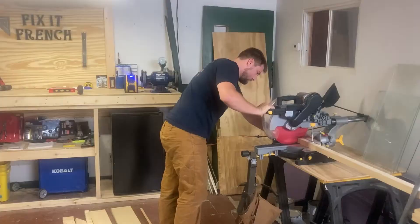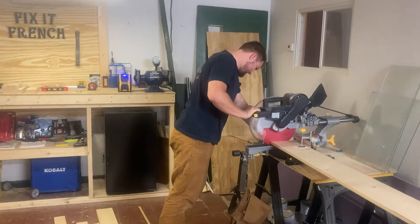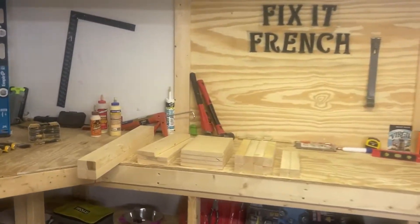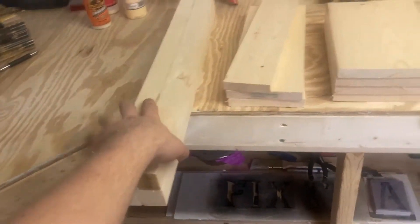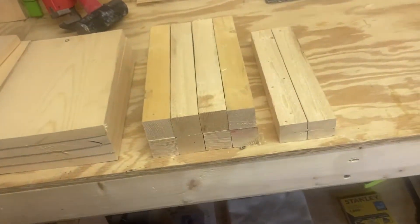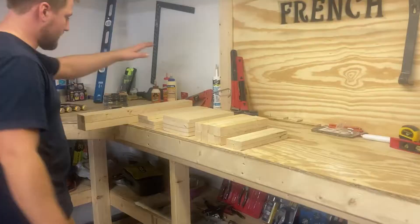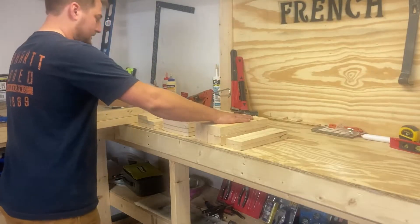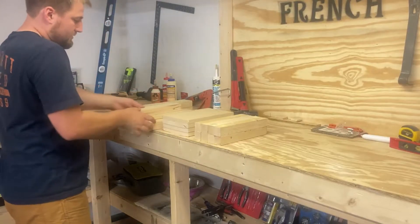What we got here is four 28-inch two-by-twos, and everything else up here is 12 inches long. We can do that because everything's going to be square — it's all going to be the same on all four sides — except the drawer, when we use our miter to cut just the blade width out. Other than that, we don't even have to worry about it.